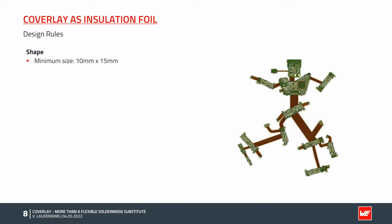The size of the Coverlay parts must be at least 10 × 15 millimeter so that it can be handled in the process. In the example on the right side, there are numerous Coverlay parts installed, and you see that one of them is only a few millimeters in size. The small size increases the process time when registering the Coverlay and therefore increases the price of the PCB. In order to be able to cover small areas with Coverlay anyway, the individual Coverlay parts should be connected to each other.